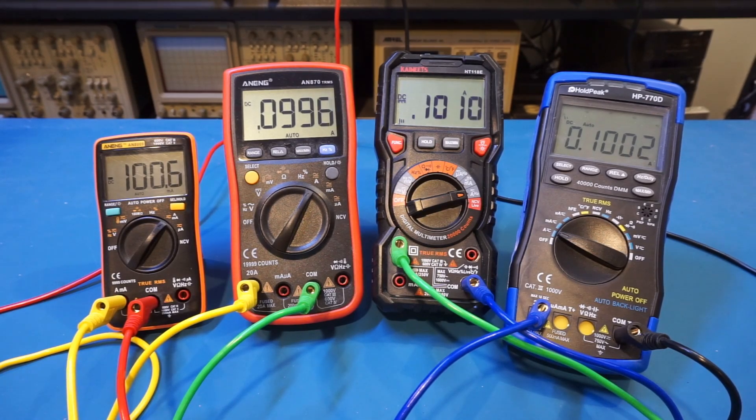However, raising the supply voltage does not always work. This is especially true for circuits that have a high dynamic current range during operation, where high burden voltage could cause significant fluctuation in the voltage supplied to the circuit under test, resulting in the circuit not working properly. The full-scale burden voltage on DMMs is typically similar across microamp, milliamp, and amp ranges.